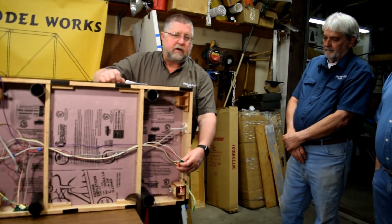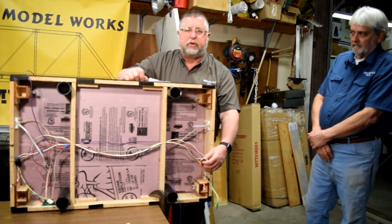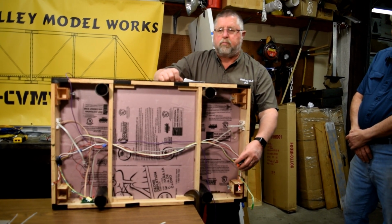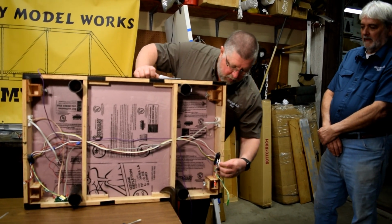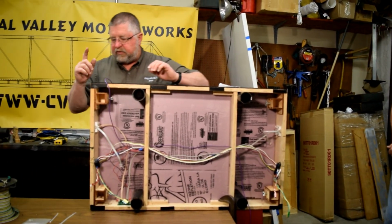I don't remember. And if you double it though, then all of a sudden you're going to get 50 to 1, and if you triple it, it's 33, and if you go 4 times, it's 25 to 1. What gauge wire are you using today? We're using 14 gauge wire. We used that same wire, the exact same wire we used for this bus. And that gets us one wrap.